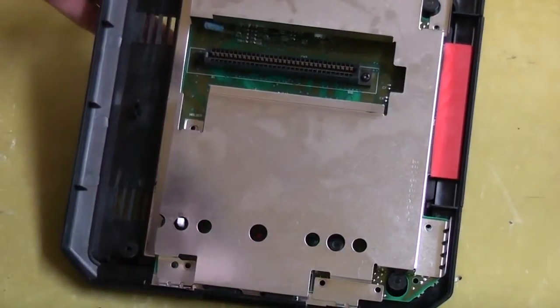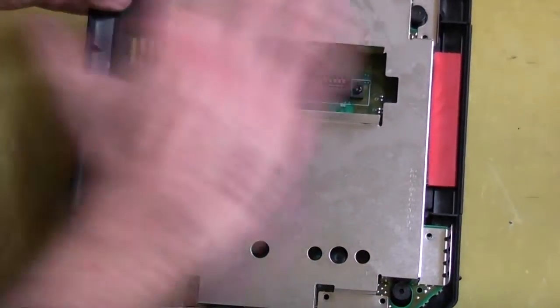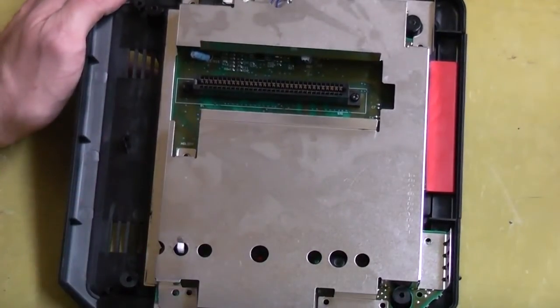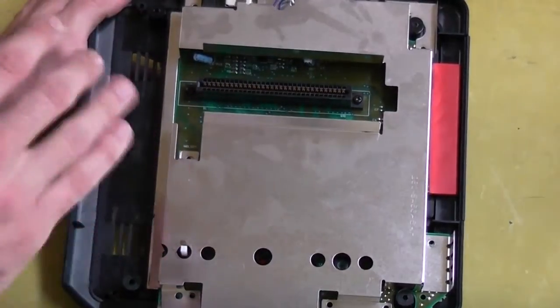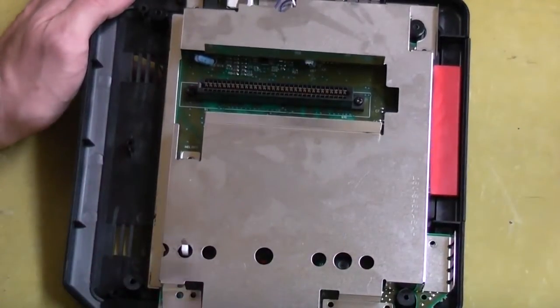I imagine these come about like most of Sega's wonderful ideas about saving costs, so this board is redesigned. The thing that makes this different is if you go to do the region switching and the 50 and 60 hertz switching on this, the solder points that I show in the Mega Drive 2 video simply don't exist on this board — they're in a completely different place.